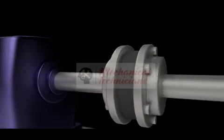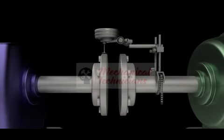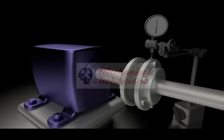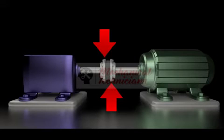When measuring runout, the dial indicator is mounted to a fixed point in space. If the coupling is disconnected, attach the dial to the shaft opposite the one you want to check. Or if the coupling is connected, you can use the mag bracket to mount the dial indicator to the base of the machines or any other fixed point in space. We recommend that you first check for runout at the hub or rim of the coupling, because there you will pick up both eccentricity and bent shaft.